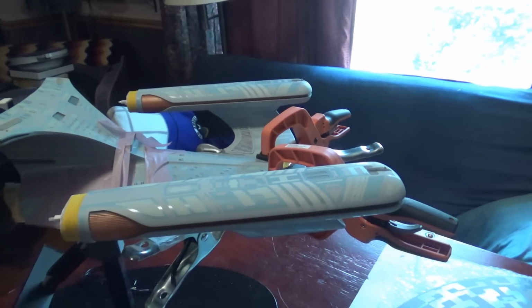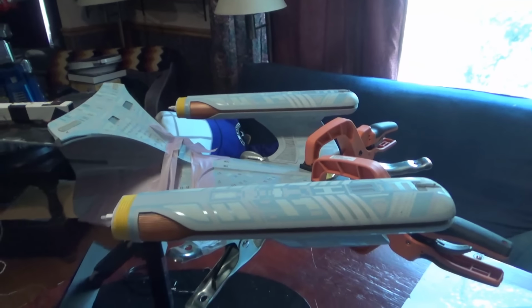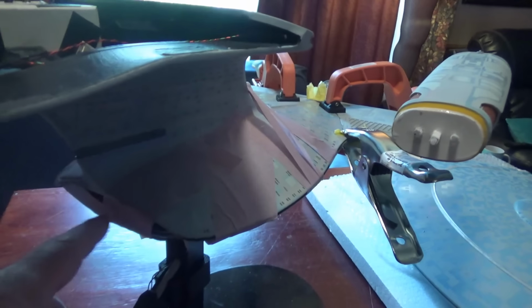I'm here. I can take them off. It's not going to get any more cured now than it was on Friday when I clamped it up. So what this is going to allow me to do is take the clamps off and dress this edge with some steel stick, and then I can have that set up overnight so that tomorrow when full-fledged work commences I can have a jump start by having that steel stick cure, because it doesn't need nearly as much time as the JB Weld does.